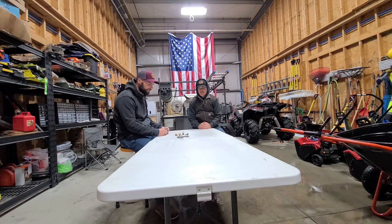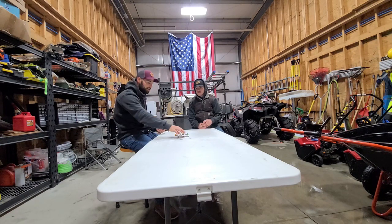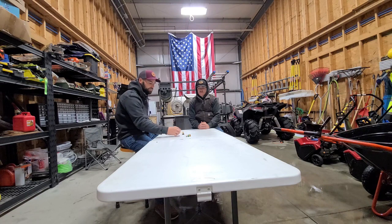So we want to talk to you a little bit about how we are able to achieve our soft wash process, our low pressure wash, the different tools that we use for that, and then also some things to know for some of the homeowner models that you may have at home and what to look out for. So I guess first we'll start with the general tips that you see on your homeowner units. You'll usually have a yellow, a green, a white, sometimes a black, and then a red tip as well.